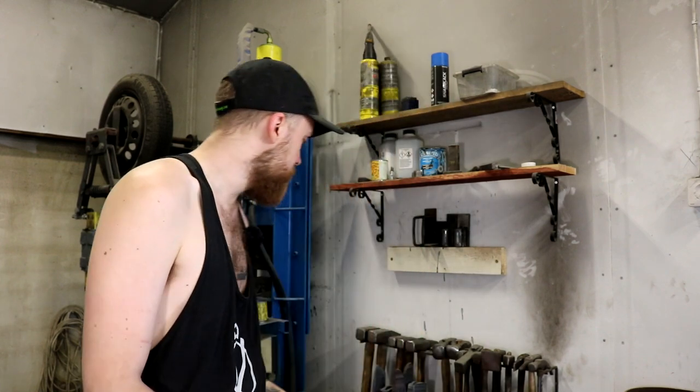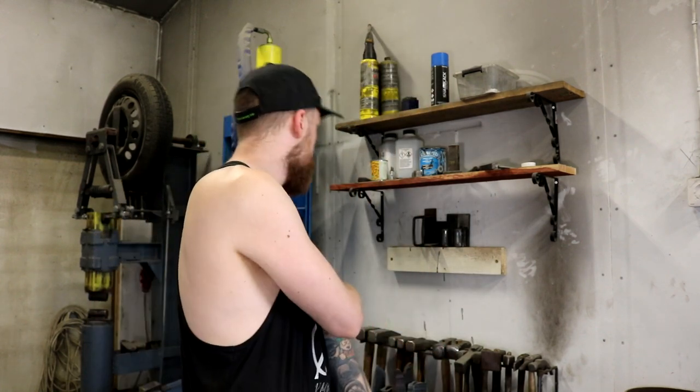So if you are working by hand and are interested in making axes, you can make one out of mild steel. However, you will have to dress the spot where you hit it sometimes, because it will mushroom like this. And sometimes it will bend, probably, if you're hitting very hard or with the striker. But if you know what you're doing, it's a perfectly good drift to start with. I have my first drift somewhere here, and I used that for over a year and it wasn't a problem. But then again, I didn't have the machines back then either. I was just hitting by hand. So if you are using machines, consider using H13. But if you are doing it by hand, this type of material will be good as well.